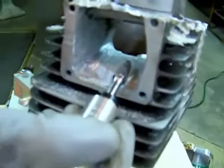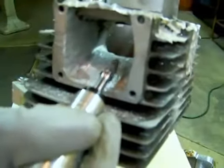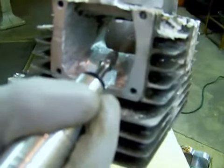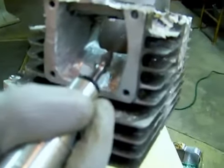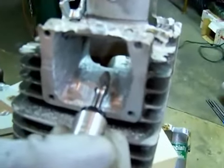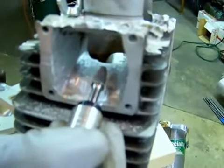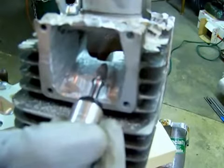The other thing is I like to use a little bit of porting wax on this. You could see at the first it had a little bit of porting wax buildup. It just helps lubricate the cutting surface and helps it move smoother. Another thing, you may want to wear some glasses. Me and Blake always do that just for safety. You can find those at CC Specialty Tool as well.